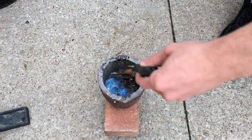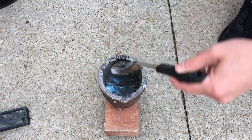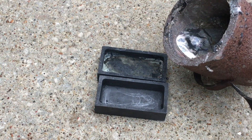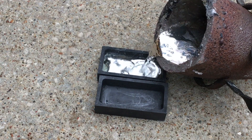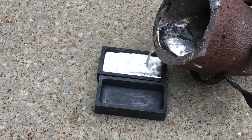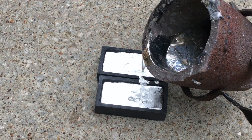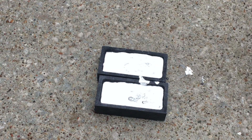Hardening of metal is great and all, but there are other aspects to a material's strength. Resisting plastic deformation is described by hardness, but toughness is the measure by which a material will resist cracking when a force is exerted on it. These properties must be taken into account when making a cast aluminum product.